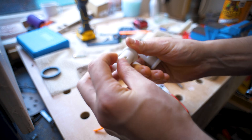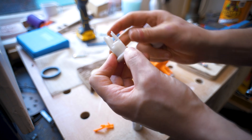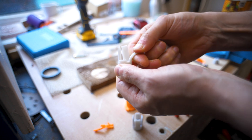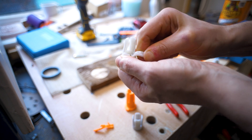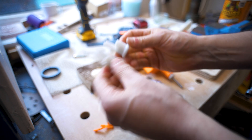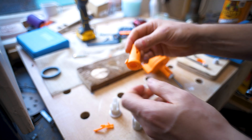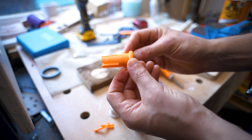Especially the layer adhesion — even though we do have a layer adhesion issue here. This is printed sliced this way, so you'd expect these expansion arms to snap off. I tested it printed at this orientation with PETG and I literally flexed them a tiny bit and they just snapped. But with this anti-impact resin, it will not snap, which is crazy — the layer adhesion of this resin is insane. I would probably prefer to print these expansion sleeves in this anti-impact nylon-like resin, but it's just very slow prototyping on a resin printer. I'm so used to printing prototypes on my Voron where things are about 10 times quicker. So I'm going to go with a PETG version of the expansion sleeve.